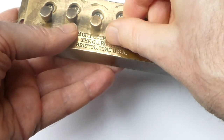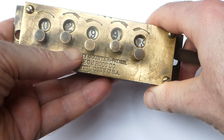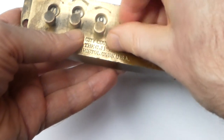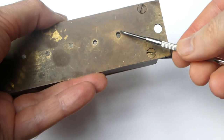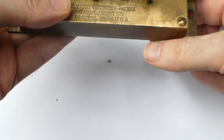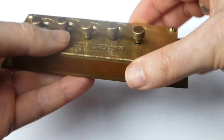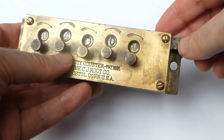Let me try that — going over three digits it just can't handle it; it doesn't click all the way through. But if I block the gap in the hole by putting this little screwdriver in here and then pull the lever, you'll see that it carries over normally. It's all the extra movement in the axle that breaks the carry mechanism — it's been used so much that it just stopped working properly.